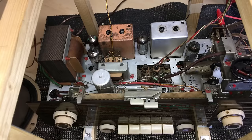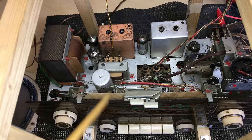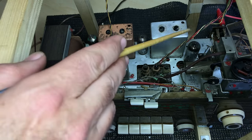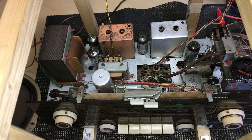So what do we have? We've got no shorts. We've got the radio working to a degree. FM seems very lively, so I'm happy with that. The AM is very very faint - it's there, it's picking something up, but very very faint. The oscillator is working because we are tuning. I've got to check the IF amp, but if the IF amp was defective it wouldn't allow FM through. The ECH-81 - if that was defective it wouldn't allow FM through. The other part is the mixer - the triode works as the oscillator amp, so maybe that's not working too well, but it is tuning.